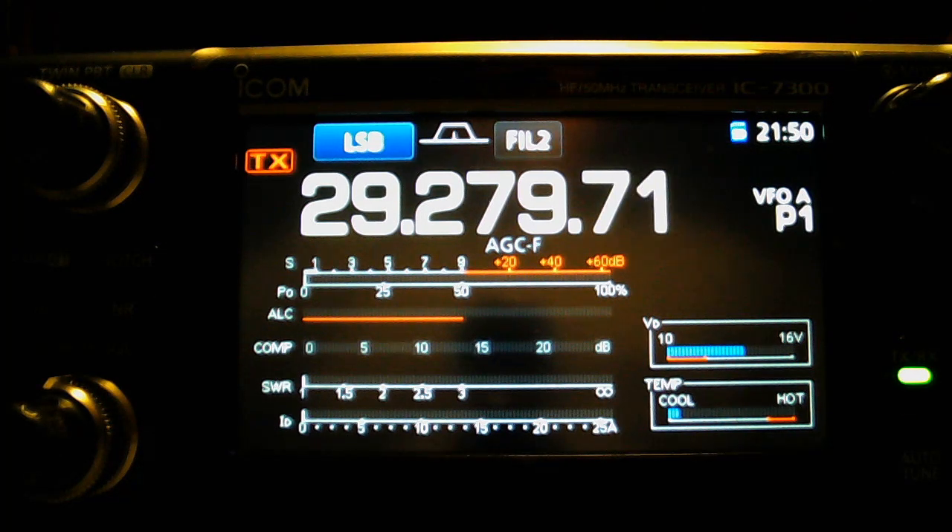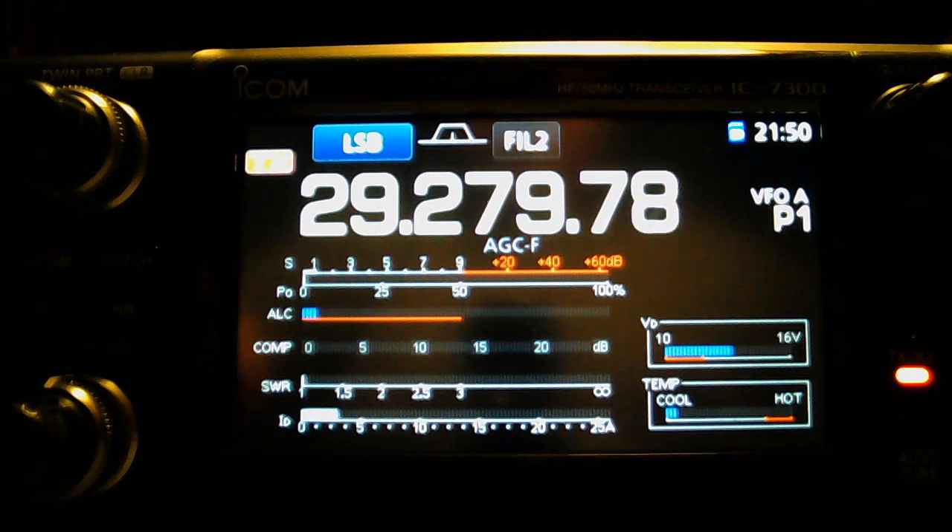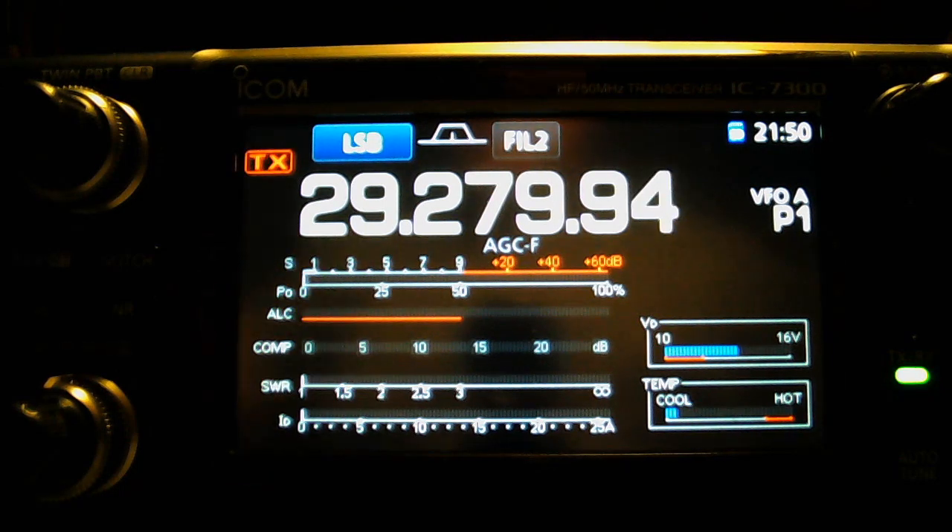I'm going to put it into TX, so here we go. See the Doppler shifting? I'm going to TX into a dummy load. Now it's TX-ing into a dummy load right now on 0% drive — see the Doppler correction still going. Very cool. Take it out of transmit. She's at apogee. This is the fastest point at which Doppler will shift.